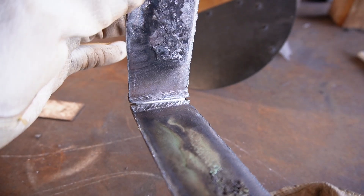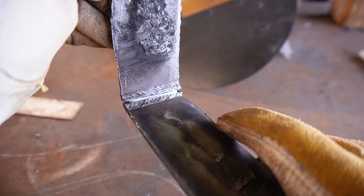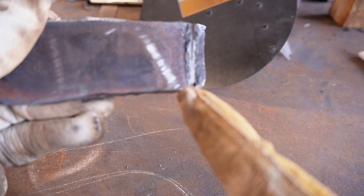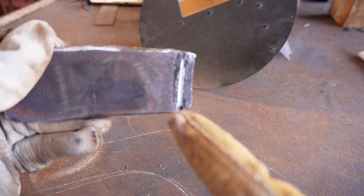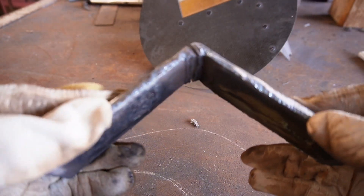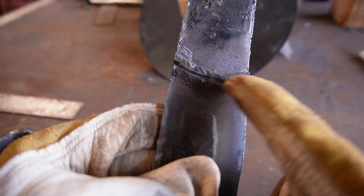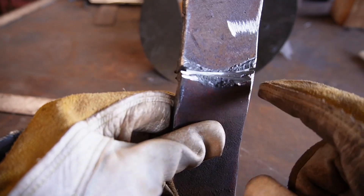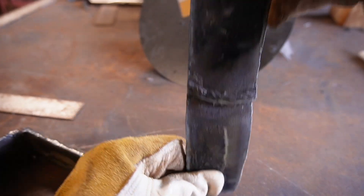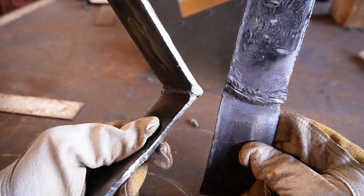This right here is the throat. As you can see, you run a small line with your cutting disc all along in the middle of your cap. On your side right there, you got to align it with your bead as well — on the bead itself, you do a small line. Then you align it and go about an eighth of an inch. This is what they're going to be breaking and looking inside. On your ears, you might have to curve it a little bit — go in the middle of your cap as well. On your bead too, and then on the sides, go in about an eighth of an inch. They're going to break it and the weld's going to come apart on both of these, and they're going to be looking at it.